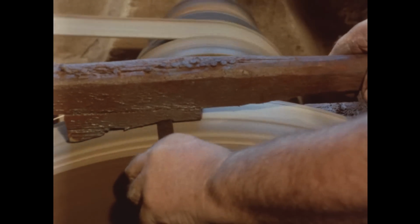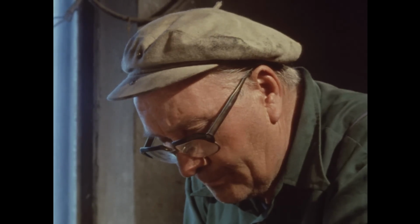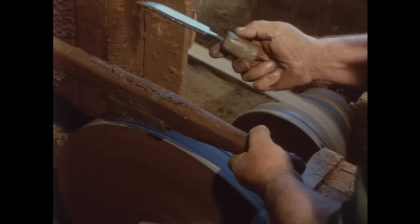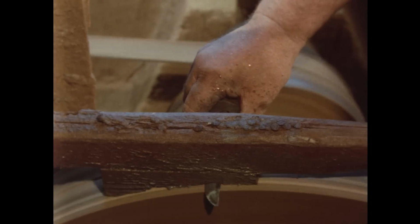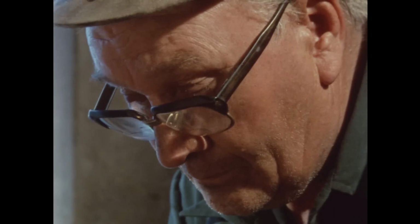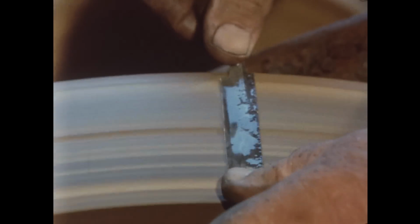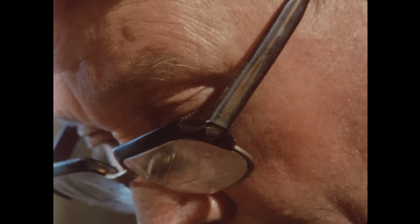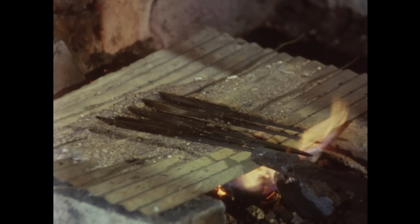The best blade can be obtained with an old-fashioned grindstone made of clay. It doesn't burn. The knife must be ground until the edge is a little turned. When the blade is being ground, there must be enough water, or else it may get too hot and be spoiled. The blade gets the right ratio between hardness and toughness during the removal of stress.